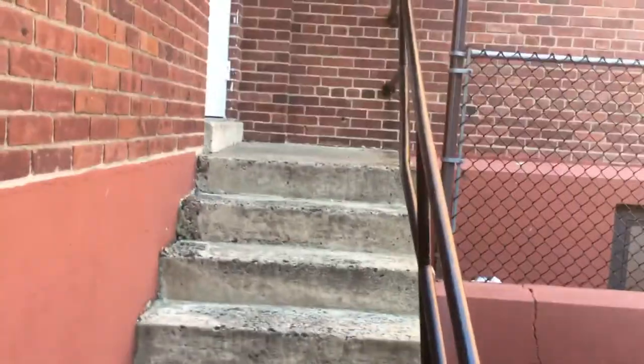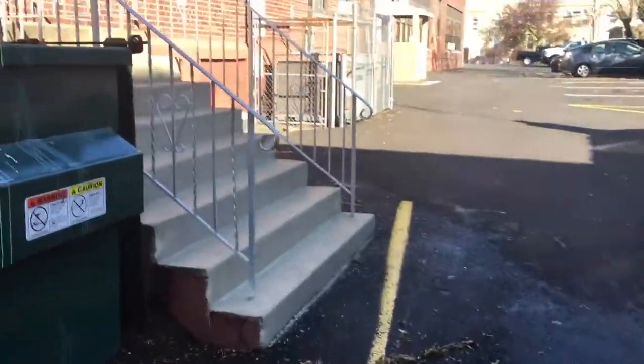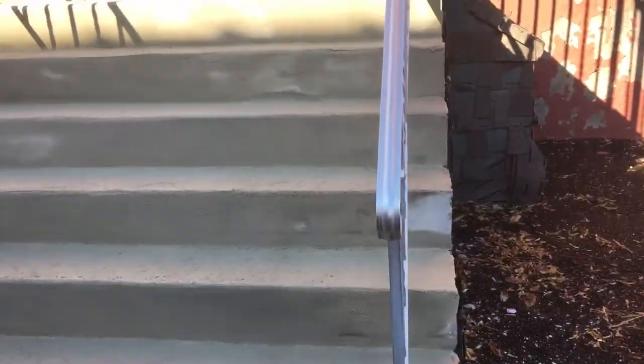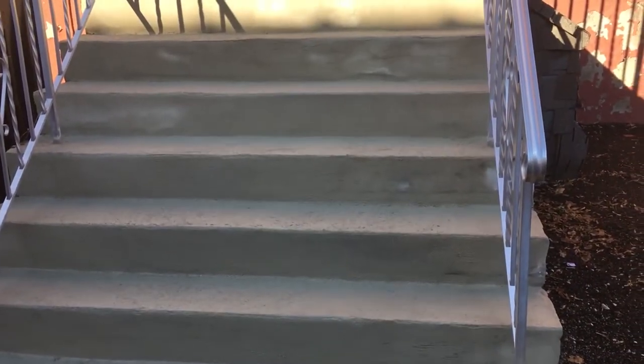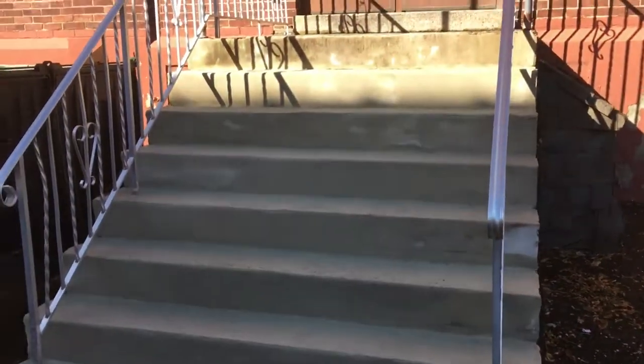Here's what these stairs look like — they could use a nice coat. I used Portland on the front of some church steps before, really just because I had it and wanted to see how it worked. But this is Cement-All mortar mix, and it does a much better job — it's a lot stronger and gives you that nice crisp white look. This should last a year or two and then you'll need to hit it again.